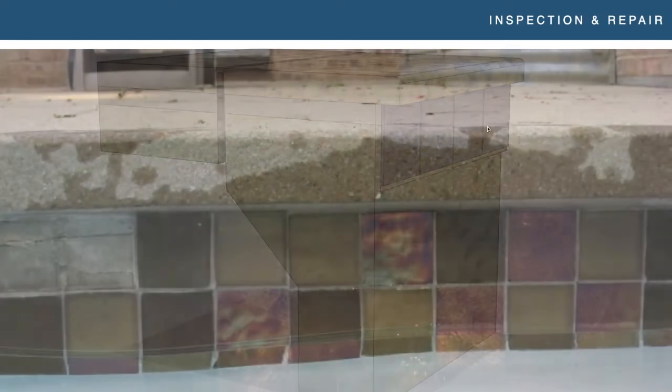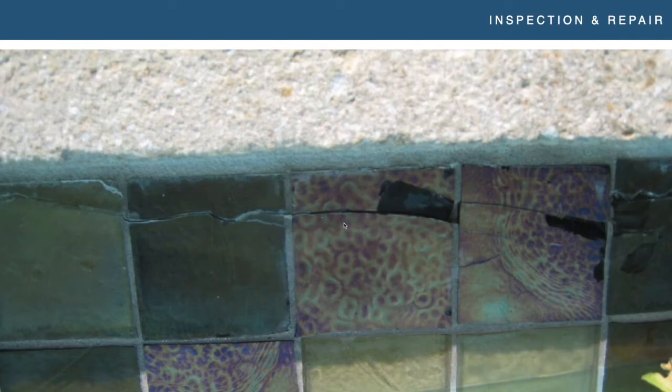Here's a good example of what it looks like when that happens. I got a phone call on this one — the customer called and said our tile is defective; it's cracking an inch below the waterline all the way around the pool. We were able to get all the defective tile in a straight line all the way around the pool. We looked at the photos and it was very easy to see: here's a crack in your substrate, tiles have fallen out, and you can clearly see the crack is behind the tile. It actually continues behind the translucent tile — they were just starting to lose bond. It went all the way around the pool, and at one end you could see that the coping had started to tent. We believe the problem was freeze combined with improper pitching on the deck and not a good enough bond on the coping — the whole coping just lifted off the top of the bond beam and tore the tile away with it.